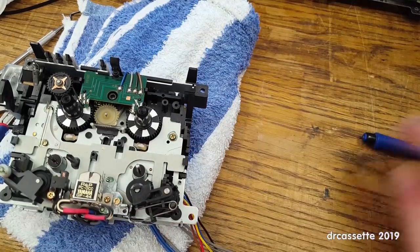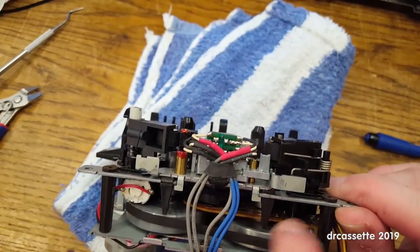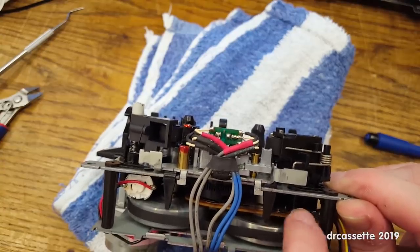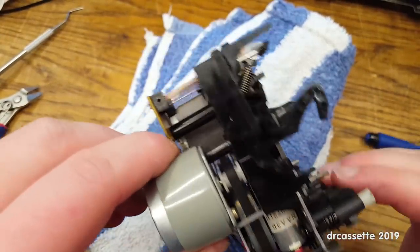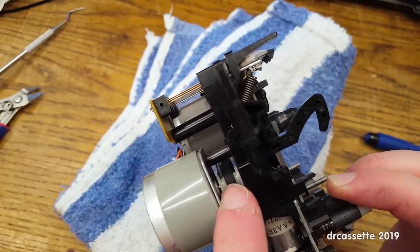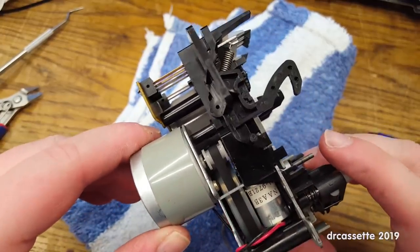And see, there is a new belt. If I turn this, yeah, let's turn. Yeah, see, there we go. That all seems fine. Yeah, see, the belt tension is correct because the belt has automatically aligned itself with the top of the pulley. If it's too loose or too tight, it'll always tend to go off to one of the sides.